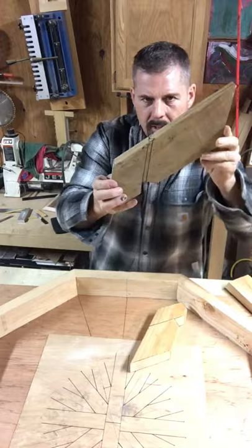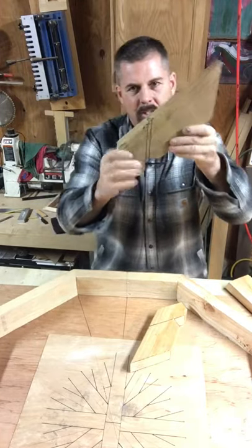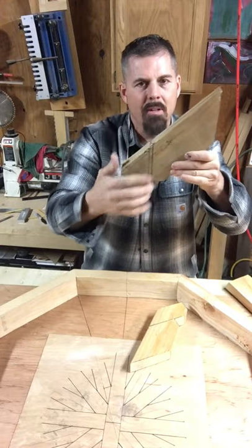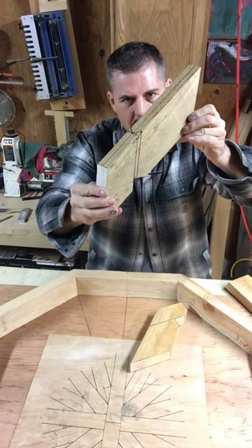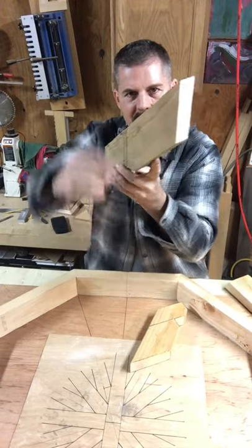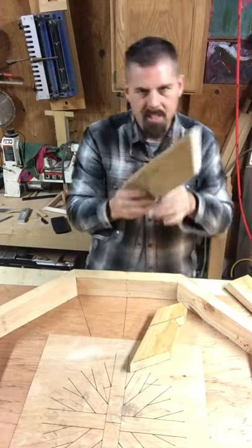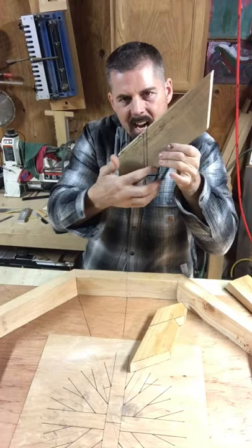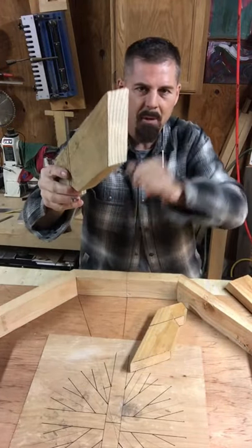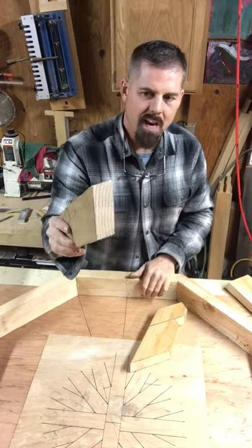But with a hip, when you calculate the length and draw your hip length line where you're going to cut your notch, you have to think in terms of the height above the plate — where it is. Is it at the rafter length line or is it inboard? With the hip, it's always inboard. When you turn the rafter away from you, you can't see the center — the center of the hip rafter is obscured. Now all hips are calculated to the center line, so if you can't see the center line, the wood is in the way. You can either back the rafter, or create a new line and notch it so it sets down a little bit lower. If you don't do that at the peak, it'll be a little high. If you bevel it, it'll be perfect. Or you can set it down so the spine stays flat, but the corner lines up with the common rafters on either side of it.